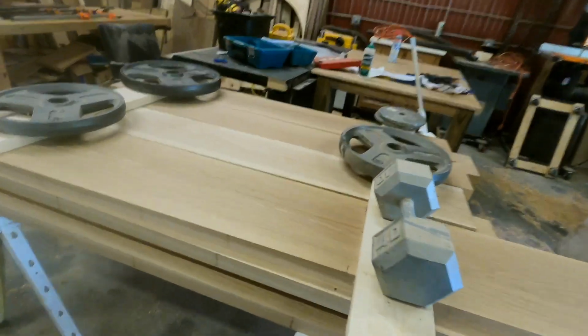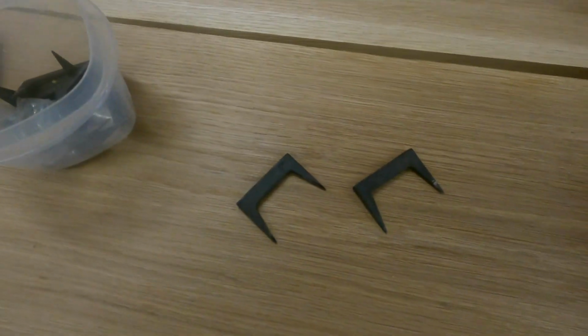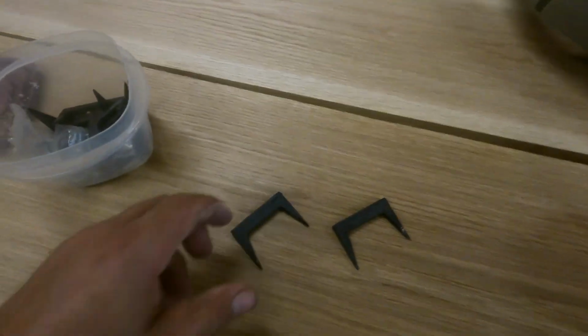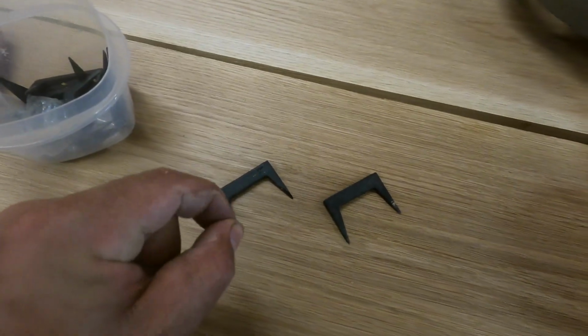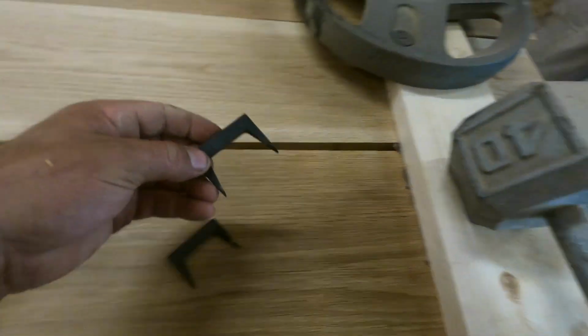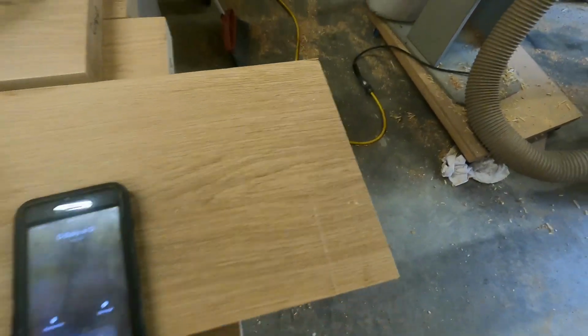And then I'll show you something that I use to bring the end grains together, because again, I'm gonna be stacking this thing, and I matched them. I'm gonna rematch the grain, but then I use these pinch dogs. They're amazing. What you can do is it allows you to really pinch the edge grain together, and then of course I'll have dominoes all through here, but then pinch the ends of the boards on the backside together, and it's like a clamp that I'll be able to hammer in.